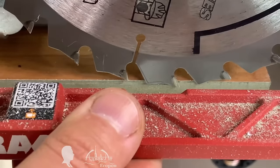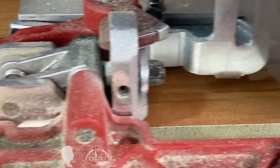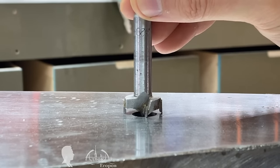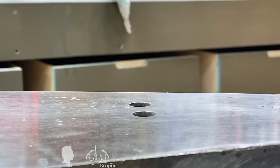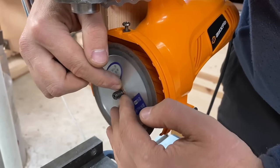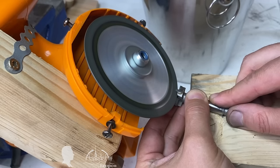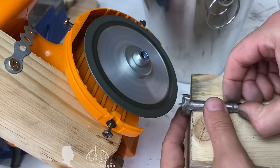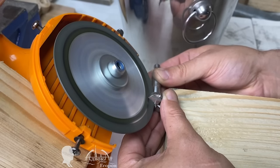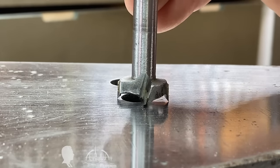Now I have to drill several 16 mm holes in the rail, and then many 20 mm holes in the countertop, so I'll need decent drill bits. A good quality Forstner drill bit will stay sharp for a long time but is at least 20 times more expensive than a cheap disposable one. Re-sharpening a cheap drill bit is not difficult — I did it using a simple sharpening tool for a chainsaw, replacing its regular sharpening disc with a diamond one, which required a small insert adapter. After sharpening, the cutting edges protrude beyond the main blade and actually cut the fibers on the outer edge of the hole as they should. If you want more information on tool sharpening, I showed how to automate the sharpening process in several short videos published on my Patreon.